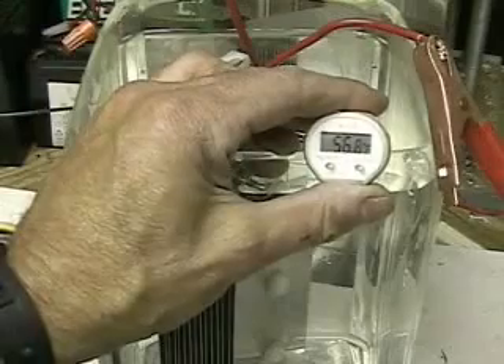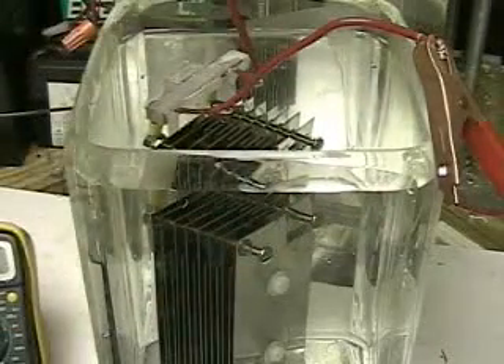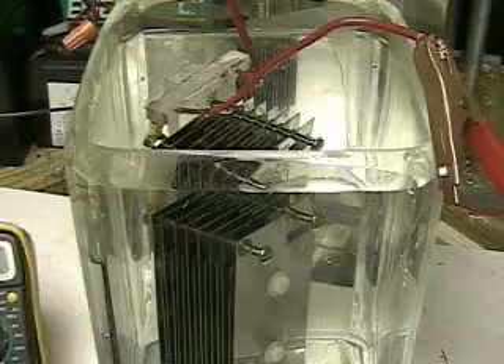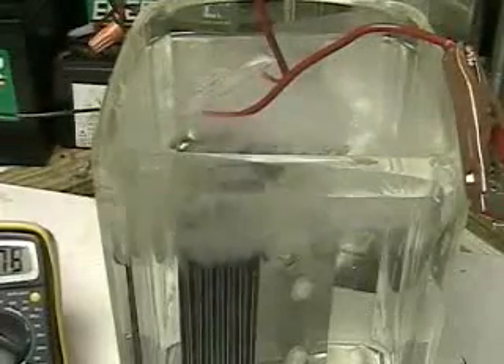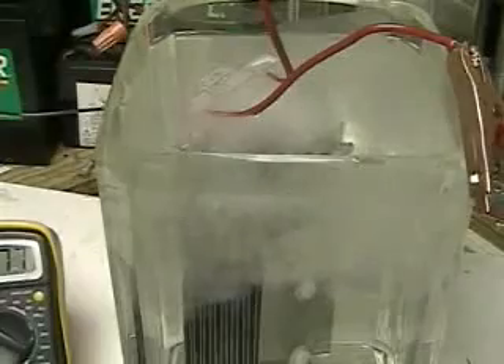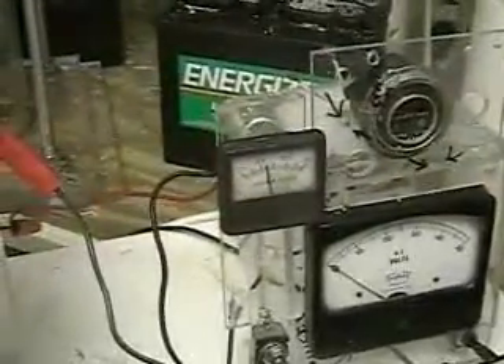Now what we're going to do is put straight tap water in this unit. The tap water has been run for 30 seconds — the same tap water you saw in the previous video that showed all the garbage. Now watch what happens. If you go back to the last video and see the tap water test, compare it with this video and you're going to notice something really interesting. This is putting out so much hydrogen that I'm going to have to turn it off, and it's only putting out that hydrogen with 11 volts. Let's look at the amp meter — you can see it's a little over 10, about 12 amps.